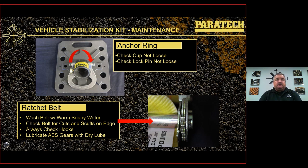For the 12-inch base plate with anchor ring: check the nuts on the sides — they rarely come loose due to lock washers. Check the lock pin for looseness and lubrication. Check the hinge cup and anchor ring — the two cutouts should be even on the anchor ring. If uneven, remove one nut, pull the shaft out to disengage the cup, adjust the bolt inside, tighten the lock nut on the other side, and reassemble.